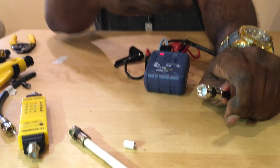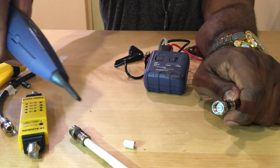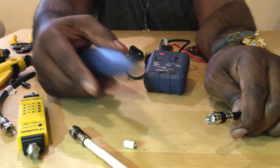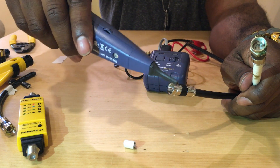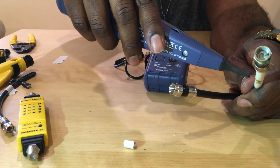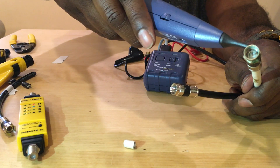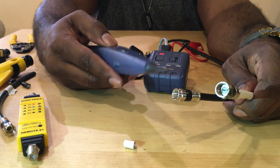With this on here I go down to the basement — I'm going to put this far away with my arm even covering it, and I simply listen to the tone. As you can see, as you get closer the signal is stronger, and as I touch the copper it is really, really strong. I'll give you an example with two wires — see how it's making the connection from my hand to the copper? Because I'm that connection point the signal is not as strong on the other one. Running it over here — see how it's a weak signal — I can say I'm close to the wire, but this is my actual wire.